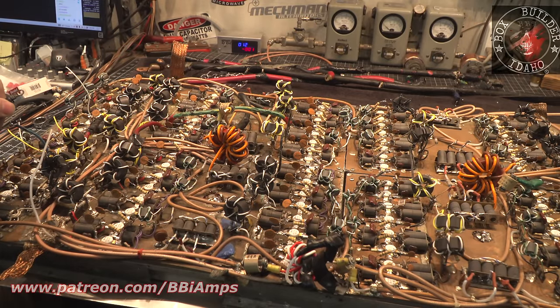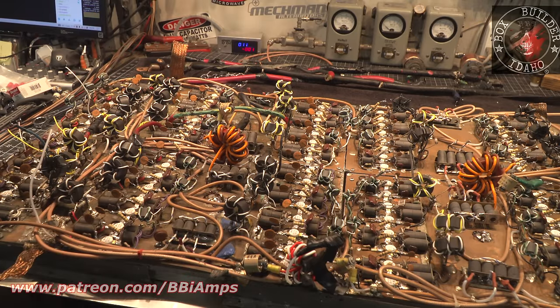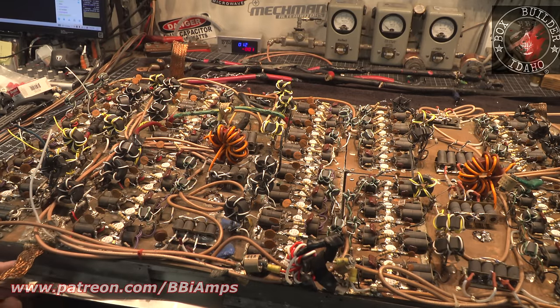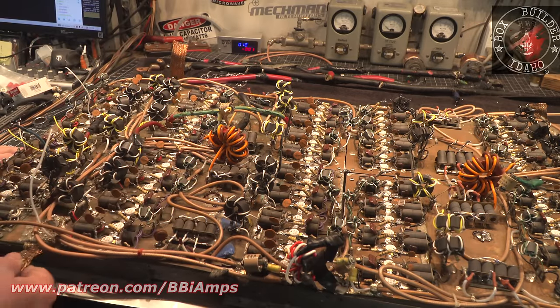It's the same thing this was used for. How is that going to carry enough current? The tin that the cabinet is made of is so thin that it couldn't carry enough current. And the attachment points for the hardware and for the heatsink were so thin that they could not carry enough current. So that's why we have to start compensating for it with stuff like this. There wasn't enough homogeneous, universal, or common ground point, so now we're adding ground straps that hang outside of the cabinet to attempt to achieve that.